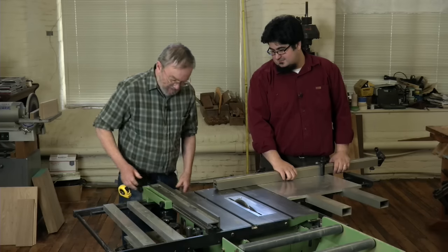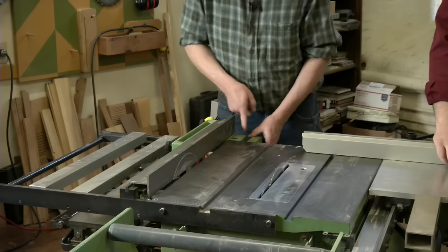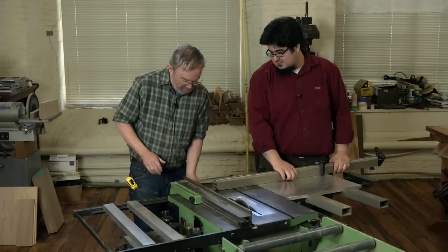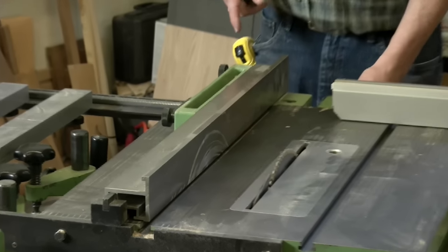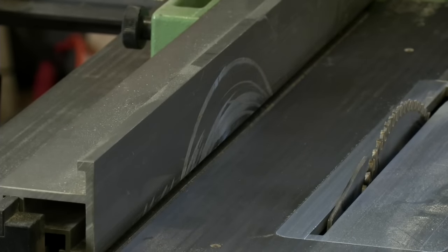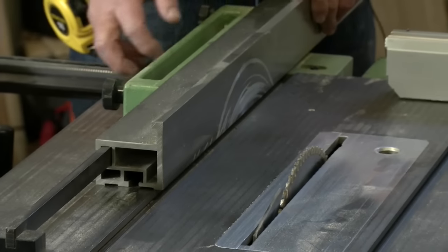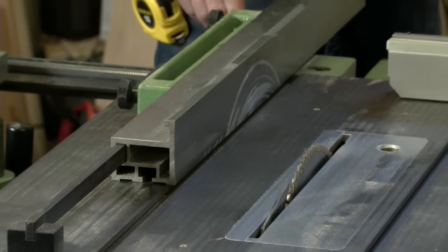For ripping, as you can see, there's my rip fence — that's all I had to do, I'm locked in square. It has a gauge there. And if I want to fine tune, I lock this little dial and I can make fine adjustments to the 32nd of an inch and lock it down. It's a really great rip fence. It's also adjustable — if your board's under tension and wants to push, I can lock it there and the board will flex there and not push into the blade.